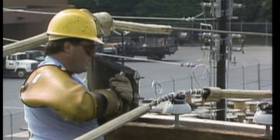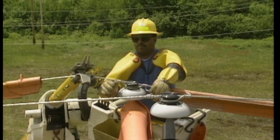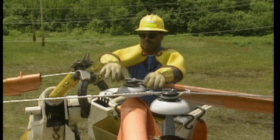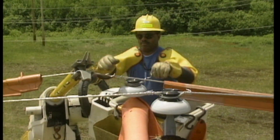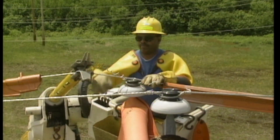For instance, if the loose end of this insulator tie wire accidentally contacts the cross arm on this 13.2 kV line, it may or may not cause a fault, depending on the conditions present. However, because of the higher phase-to-ground and phase-to-phase voltages present, the same accidental contact on a 34.5 kV line will almost definitely cause a fault, especially if the cross arm is damp or green.